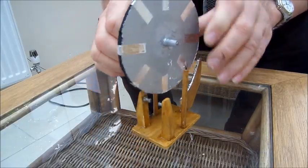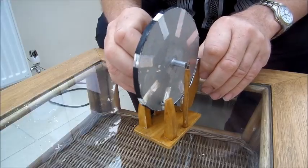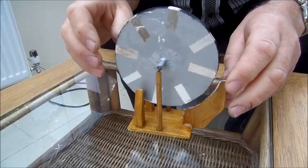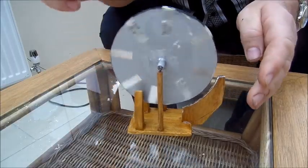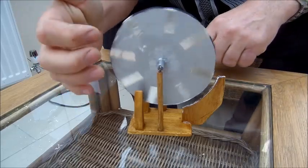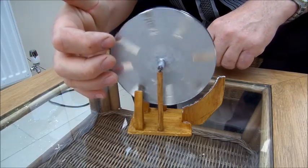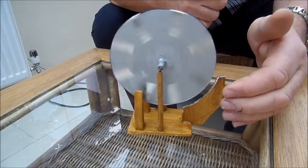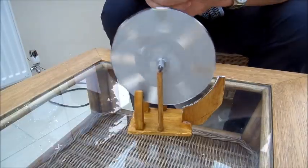This concave strip has the exact reverse effect of drawing the charge out of the plates. In a way, you can think of these plates as being little tiny capacitors revolving on a disc. The effect is that the charge changes on each plate as it turns — on this side the charges are positive, meaning fewer electrons, and on this side they are negative, meaning more electrons. This imbalance between the two sides of the wheel generates a turning force.